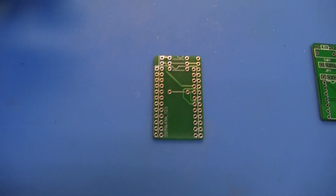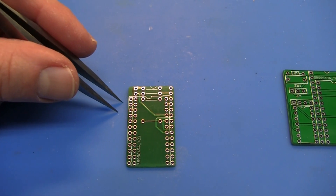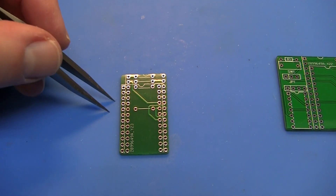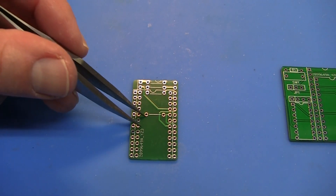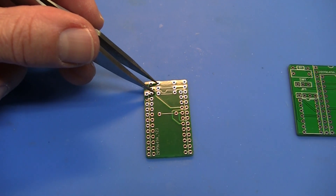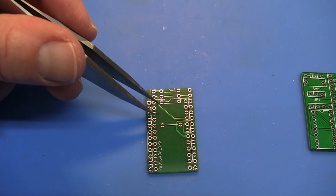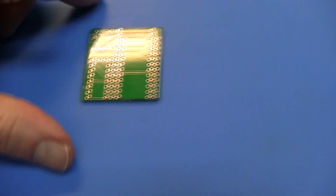I went after two possible solutions. The first is a 24-to-28 pin adapter board - these are common, but I tried to make it as narrow as I could practically make it. There are four jumpers in here that basically just tie certain enables and unused address pins to ground.